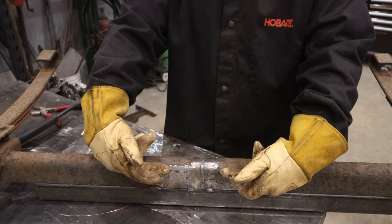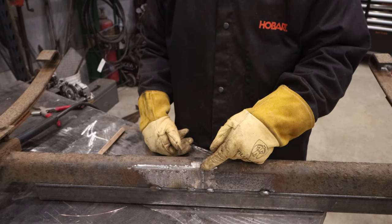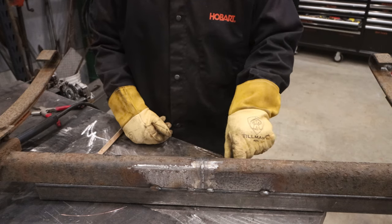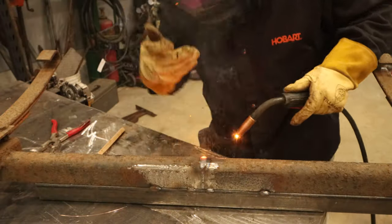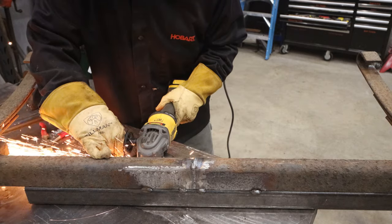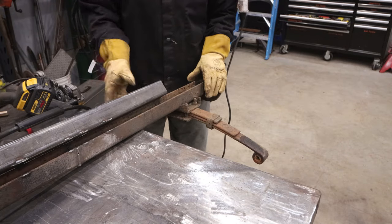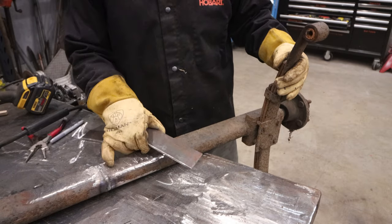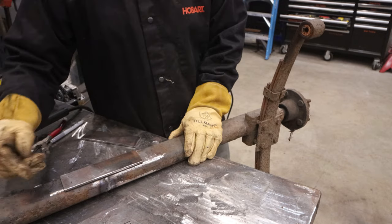The double plates are going to go from the bottom of this rolled edge down, so they won't be over the rolled edge on the top. I'm going to do another pass just across the top here to bring this area up nice and thick, and we're going to keep the ones on the side down below flush. These double plates are just going to cover this side up — I've got to fill a little hole there, but they go on just like this and we'll weld all the way around.